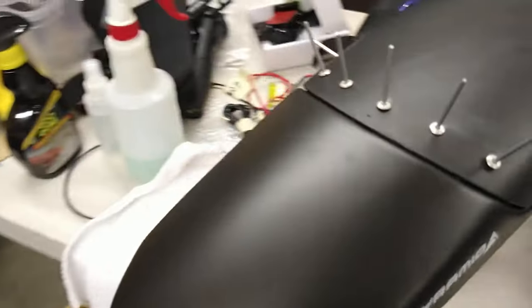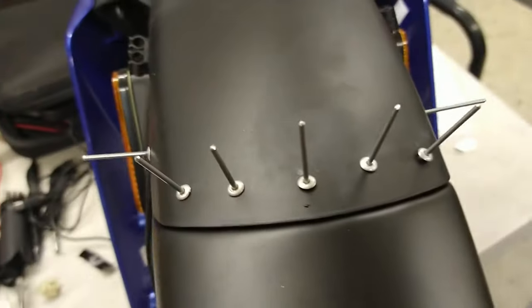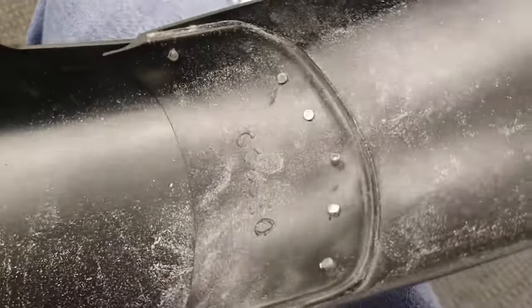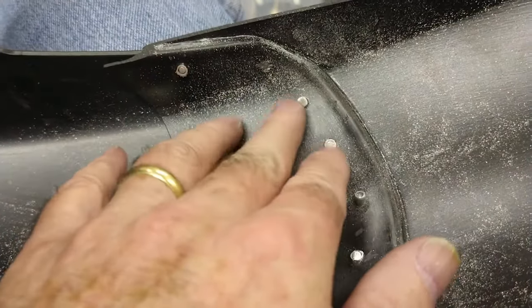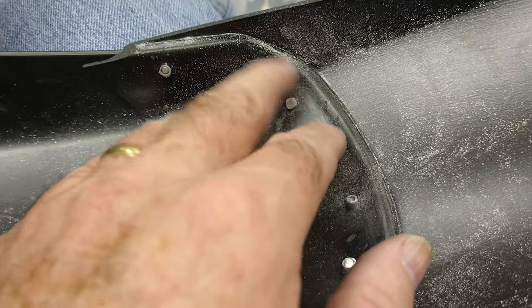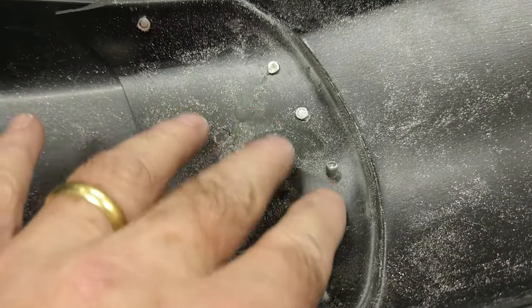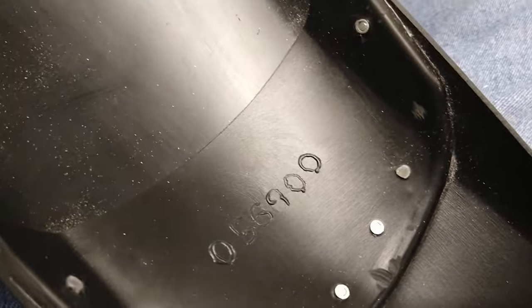Now I've got all seven in place holding their place, so I can go ahead and set them in. This is with all seven of them in — this is the front side, this is the inside. What I'm doing here is using a Dremel tool to shave down and grind down these aluminum rivets that are coming through. I'm not getting it perfectly smooth — I don't want it perfectly smooth. I just want to take off a little bit. You can see how the ones I've done are a little bit shorter. I've got all seven rivets smoothed down a little bit, but they're still sturdy and holding tight on the other side.